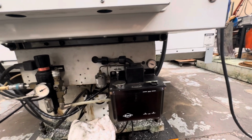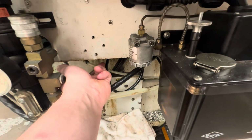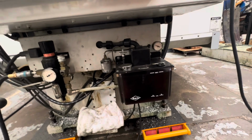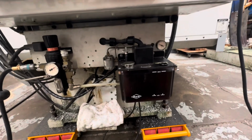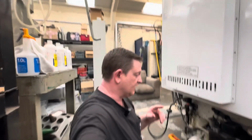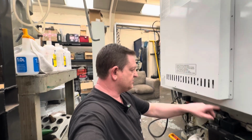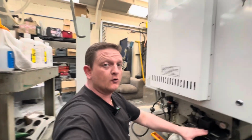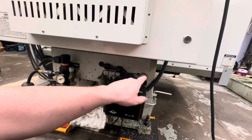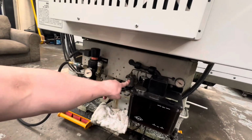So all I done earlier on is I manually took off the spindle line for the minute, and I put some drops of oil down it so I can warm up cycle the spindle, knowing that there's going to be a bit of oil to the bearings and you're not running it dry. But there's obviously a pressure issue on the other side of this system, which is not allowing that to drop. So the pump itself is doing the cycle. The pump itself is cycling, so that side of it works. Oil, when you pull the lever, comes out to here fine.